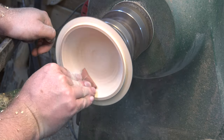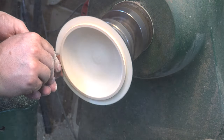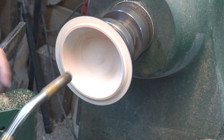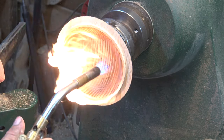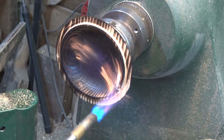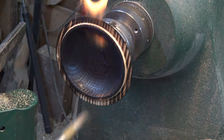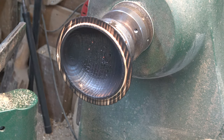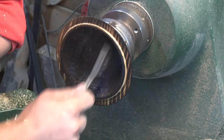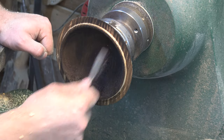We're going to be using that Japanese technique, Shou Sugi Ban again, to blowtorch this, scorch it, and wire brush it back — exactly the same as with the top. We're going to be adding a wood dye finish using the same principle, so I'll just speed this section up. It's quite nice that the top of the box and the inside of the lid will match. I'm going to do the same thing on the flame section and we'll have a look at how that looks next.